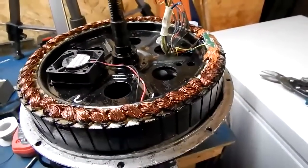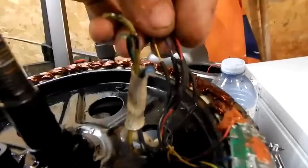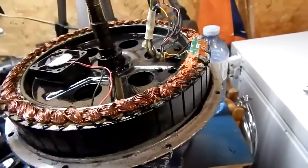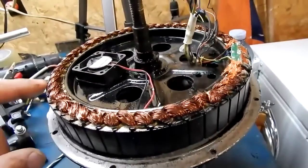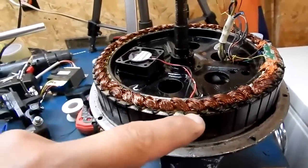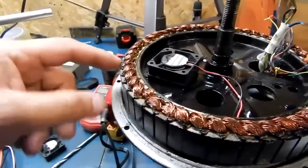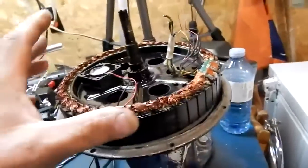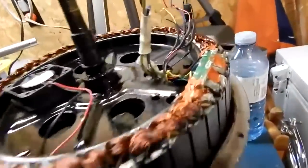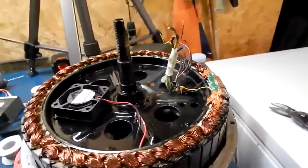It's not too bad. When I first bought it, I damaged the phase wires, so you can see I've spliced into it before. The stator was a little bit lighter than this, so it has darkened quite a bit. But as you can see in the slots, it's not black, which is good — so it means it's not overheating to the point where it's cooking. It's just baking the enamel just enough. You can smell it; it does have a smell to it. I managed to save it.